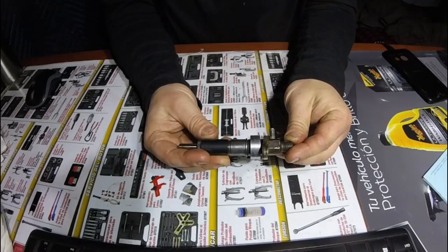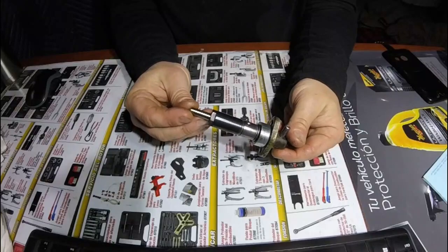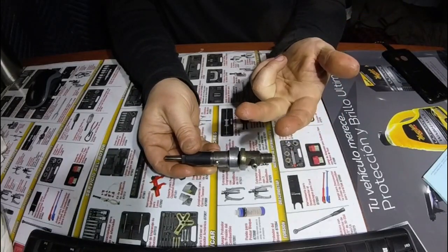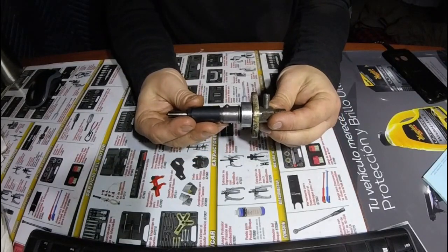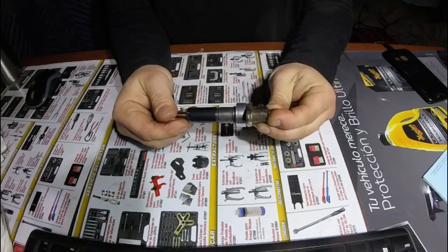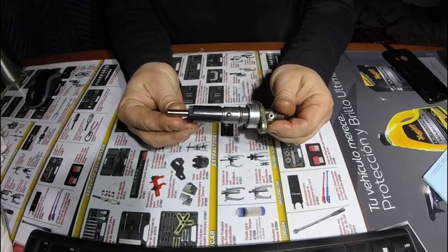The fuel carries away a lot of the heat that's gathered whenever combustion events occur at the tip. Whatever is pushed up around the needle goes up through the body and out the return — that's how you can have a return. It's really just a controlled leak with very tight clearances, but just enough for fuel to push through. That's another reason I was looking in here to see if there was any discernible wear, because the waste oil being burned in this is pushing through all of it — lubricating the injection pump, lubricating the injector, cooling all this. If there's a problem with the cooling properties or the lubricity of the fuel, it'll cause damage. So far I don't see anything, which is really cool.